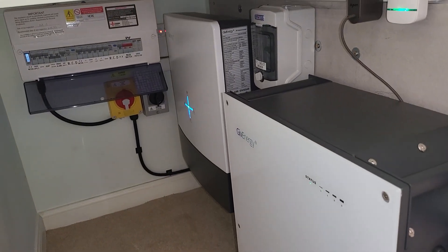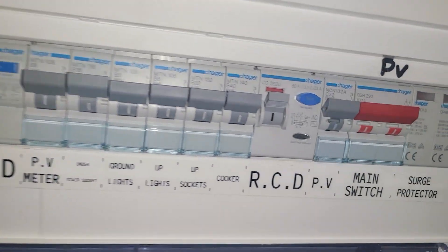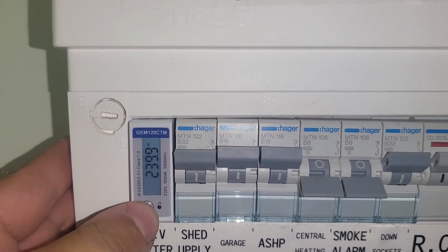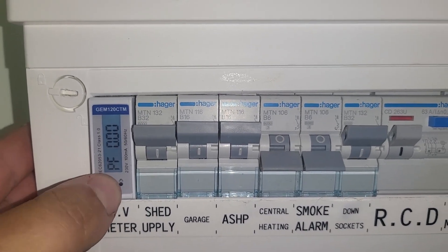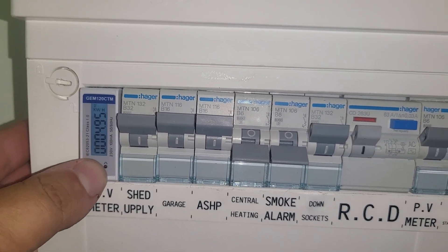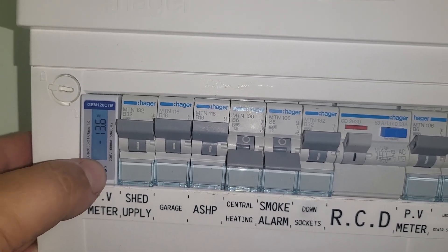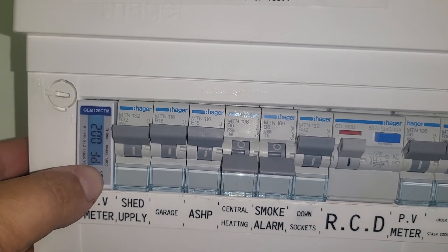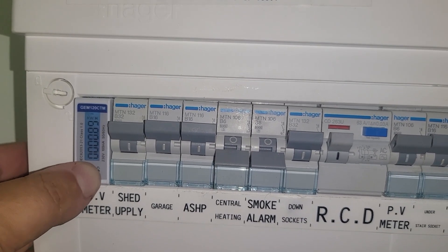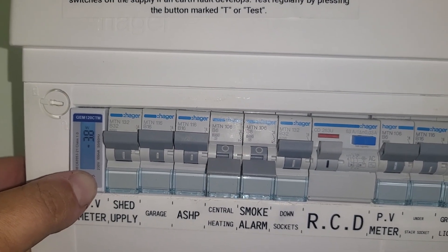You can see all of the information on the side of the inverter — the same on the battery as well — and you'll need all of this during the commissioning stage to get the system set up. The customer cannot have an account or access any of the GiveEnergy equipment until it's first commissioned. The smoke alarm MCB is in the off position so we can install a multi-sensor smoke alarm within this cupboard space — we want to make every effort to alert the occupants to an issue. This is a LiFePO4 battery; they are incredibly safe compared to old lithium-ion batteries, but we do want to make sure there is at the very least smoke detection, and we're mounting this onto a fire-resistant board.